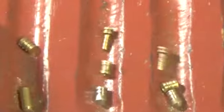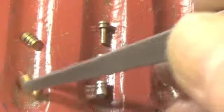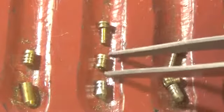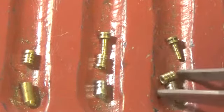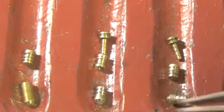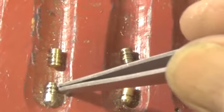All right, let's take a close look at these pins. On one, two, and three: this pin is actually a standard pin, this is a serrated pin, and this was a pin-and-pin with a serration on top. This is a serrated pin, and this was a spool. Serrated key pin, serrated key pin — on one, two, three, four, and five — serrated.